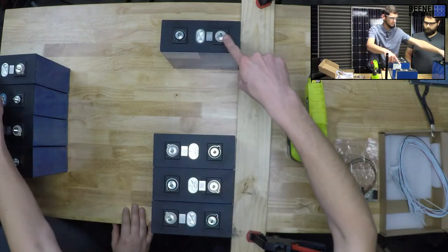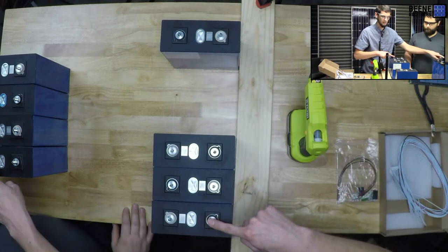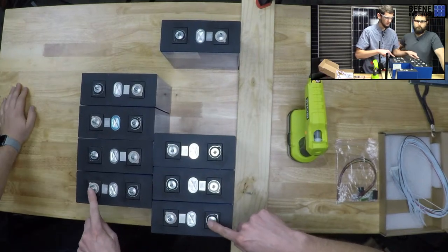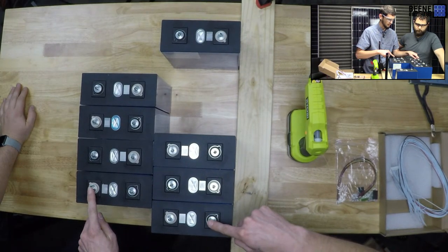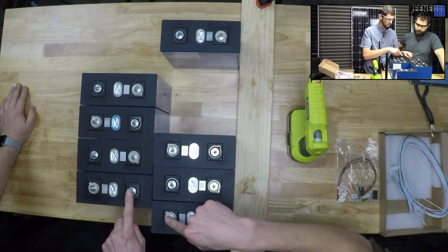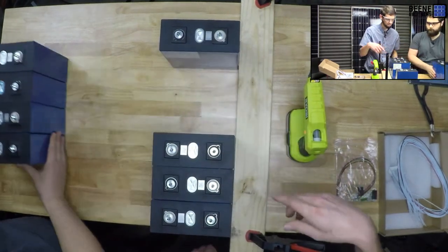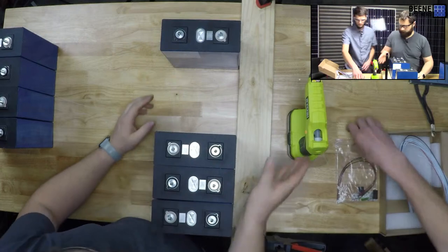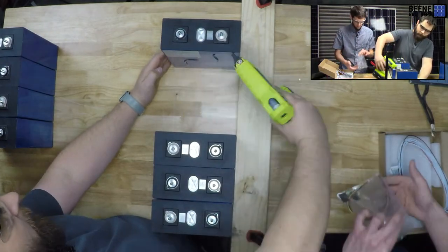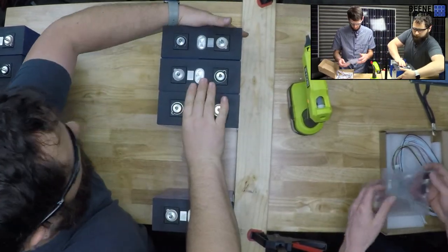If we made the main battery terminals on the outside here, then we'd end up trying to go from here to here. We'd end up trying to jump this to here with a bus bar, and that would be kind of awkward. I guess if we did a flex cable, we could do that. I've got some copper sheet that I can jump this with, since it's going to be a larger space with that all thread down the middle. So yes, that's the way we want to do it. Certainly no expert in this. I'm just trying to improve every time I do it.